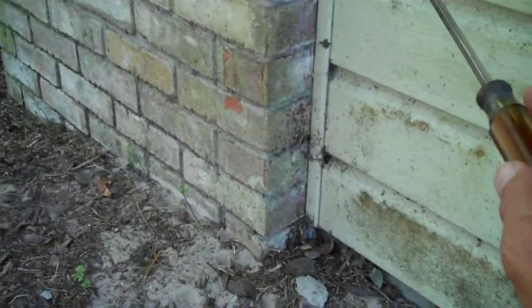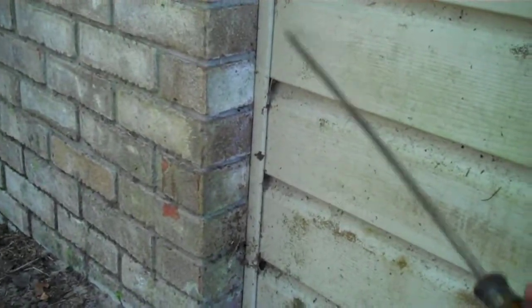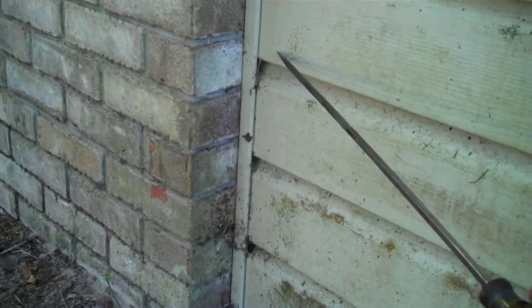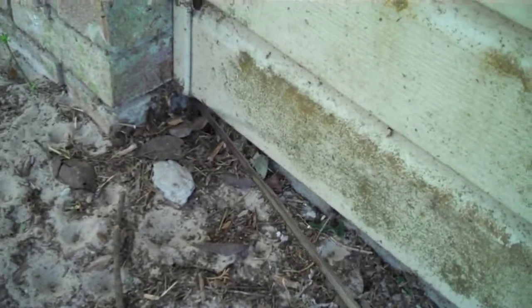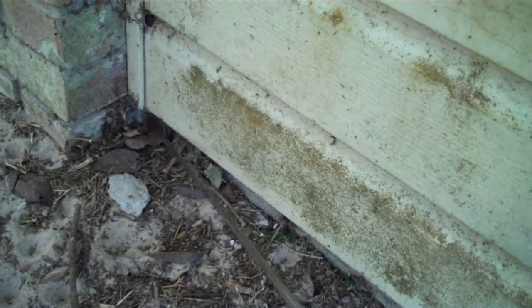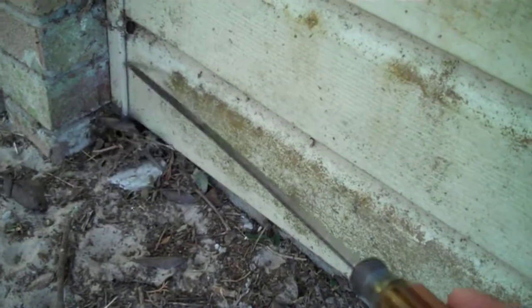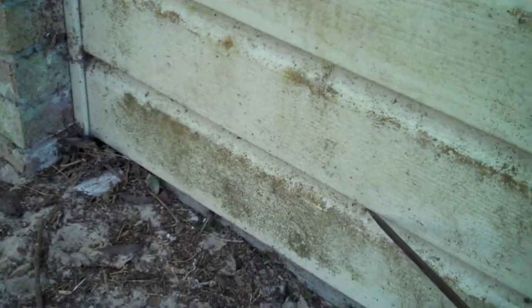But right in the corner here where the veneer meets the foundation wall, that'll just be studs behind it. But all the way down, right in the corner here, is going to be a gap. Even if it's just a 1/64 of an inch or slightly bigger, the termites just love it and they can get right in on up underneath of it and in, and that's how our termites got in and crossed the barrier and are eating on the wood in there.